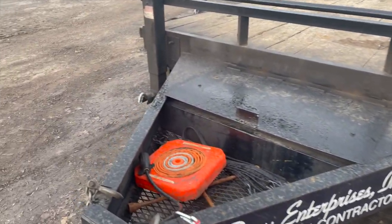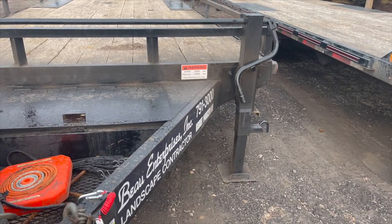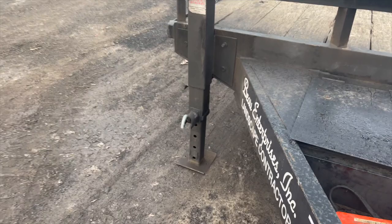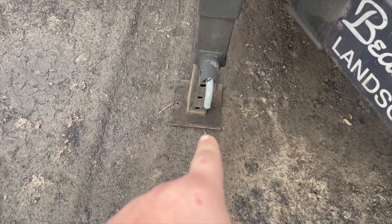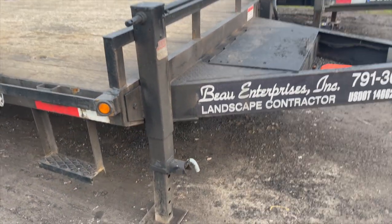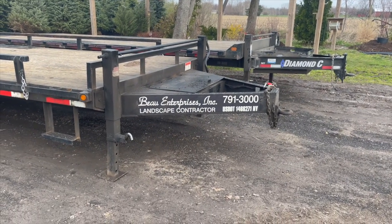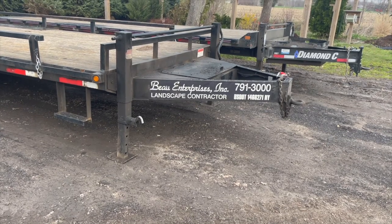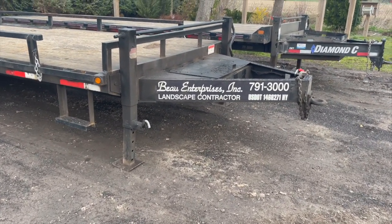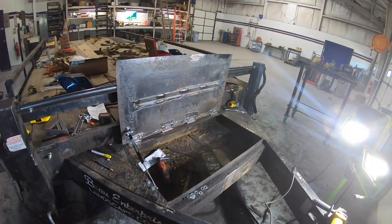The gas shock also holds the lid down so it would take a severe amount of bouncing to pop it, compared to a latched version — either way I'm satisfied. If I'd change anything, I'd lower the jack mount a little farther down as it's almost too high and the jack legs have to go all the way out. The solution is just don't retract them all the way — if you raise the jack off the ground, pull the pin, it'll retract with plenty of clearance. It's not a big deal, just a slight learning curve. Now we've got dual jacks. If you liked the video, subscribe, like, comment below — thanks for watching.